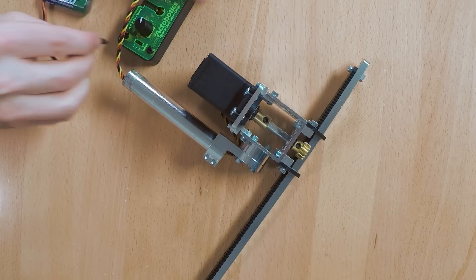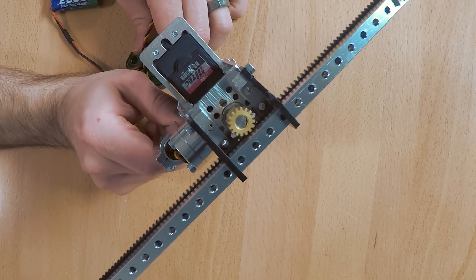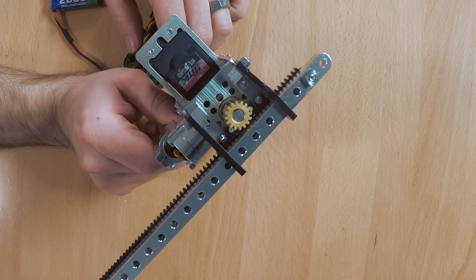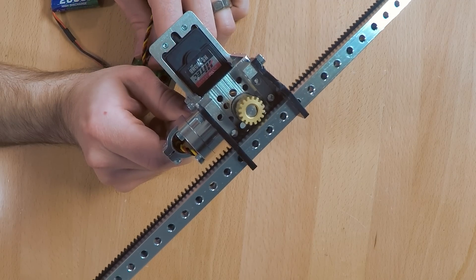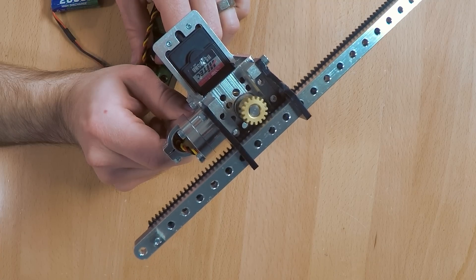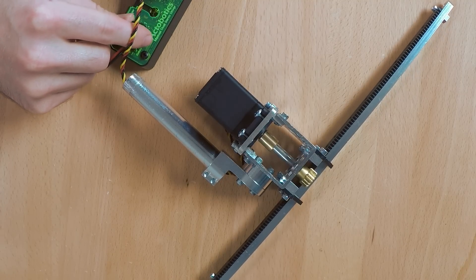The second assembly we're going to show is our 785 gear rack kit. We created this kit because it is very unique — the Hitec HS-785HB servo is a multi-turn servo, and there are very few on the market like it. Since this servo is a multi-turn servo, it's able to run the gear rack all the way from one end to the other with the proper PWM signal while retaining feedback. It has a lot of thrust and there's no chance of slippage because the gear rack is pressed up against the pinion gear. We actually have four different versions of the 785 gear rack kit — some with a single gear rack and some with two gear racks, one on top of the pinion gear and one below.